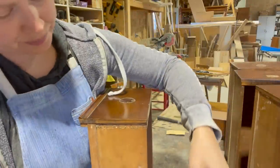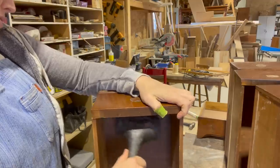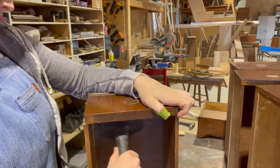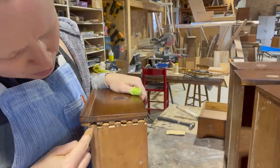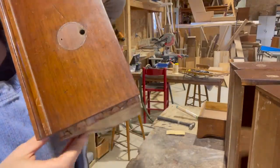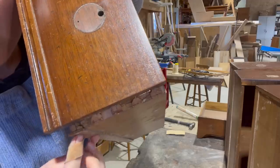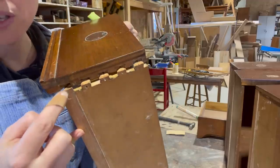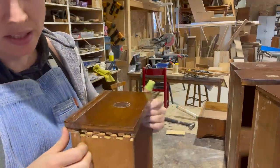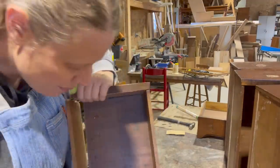Got one, and it looks like I'm just gonna, like they've even got a nail going right through this. You can see all the nails right there coming through those dovetails and one going right through the runner here. If this starts to pop, that's gonna gouge the side of your rail on the inside of the cabinet. So these will cause issues in the future, if not now.